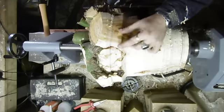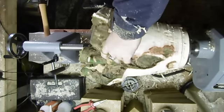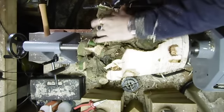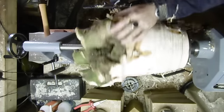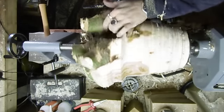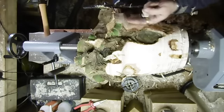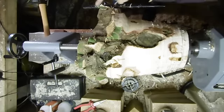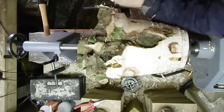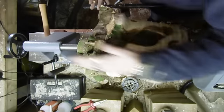I've got this here that could come out. I'm getting a slight undercut as well. There's a bit of rot down here — slight undercuts all the way through there. So I don't really want big noggins coming off. I'm going to be taking it down gradually to level it off. That's one thing you've got to look at as well — when you've got something so irregular here, you don't want to be coming across this way and a big chunk fly off. Even at that speed, you don't want it at any speed really. I'm going to be taking this off gradually, standing obviously to the side.